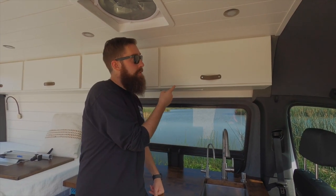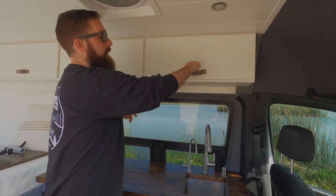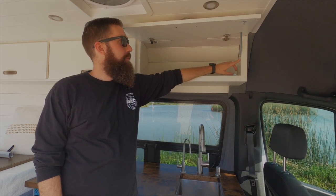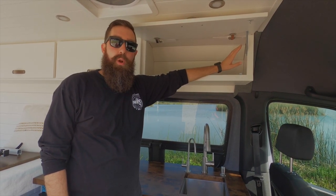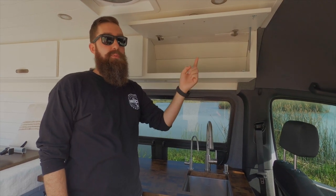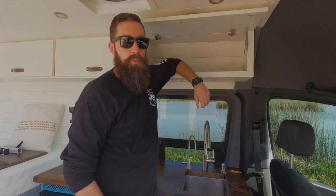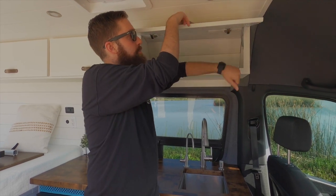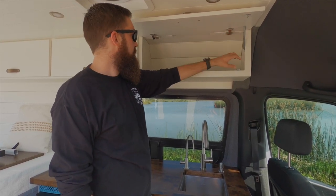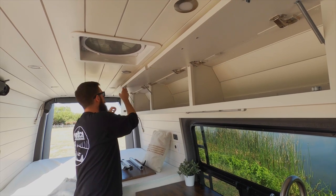Moving on to the upper cabinets — they're all solid poplar, base, front plate, everything. Leather pulls on them as well. Here's a little tip if you're looking for something lightweight for your hinging. Some of the RV hinges push up too much and hit the ceiling — I went through probably three or four different types of hinges. This is just a spring from any hardware store. As it extends fully it will kind of lock the cabinet in place, and all you do is just push it in and it will go in. You can see how it locks itself out there. All upper cabinets have their own individual hinges — sometimes you have to adjust them a little bit but for the most part they work pretty well.